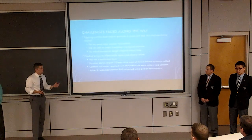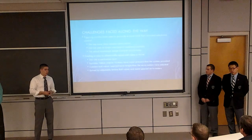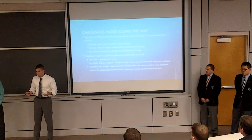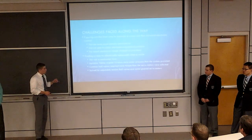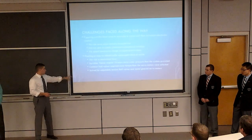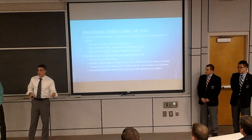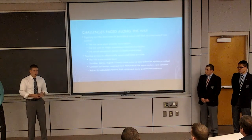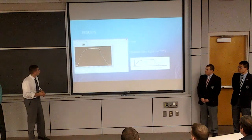And then we just didn't want this to become a mechanical issue. That was something we talked a lot with Dr. Peoples about. We didn't want to overcome a mechanical or plumbing problem, essentially. We wanted to actually be able to electronically control this. And that turned into working with the ball valves and figuring out how to get a ball valve to decrease the tension so you can actually use a relatively low-cost servo motor with it.